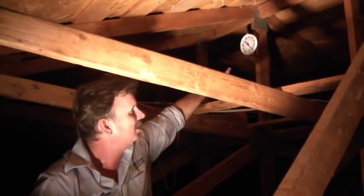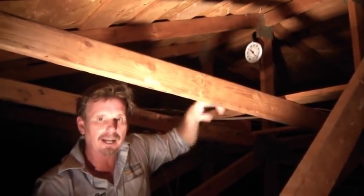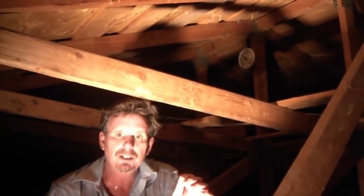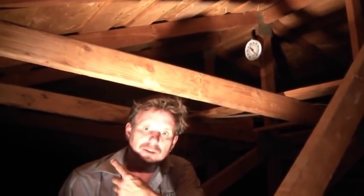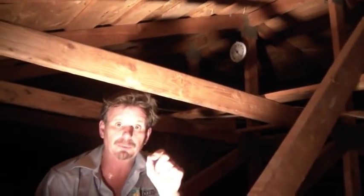If you're going to do an attic inspection, you've got to take the proper steps. We're putting a thermometer on the roof to check its temperature. We've got a thermometer installed in here — we've been up here about two minutes and we're looking at a little over 120 degrees. Most attic spaces on a 90 degree day are between 120 and 150 degrees. A properly ventilated attic is going to be 5 to 10 degrees above the outside temperature. Our house next door where we just installed the two Solaro Airs was at 105 degrees with 98 degrees outside. In here, we're at 125 and we've only been up here about three or four minutes.